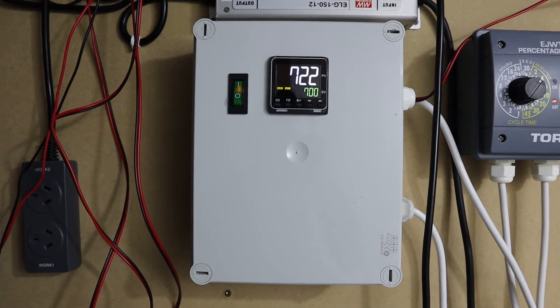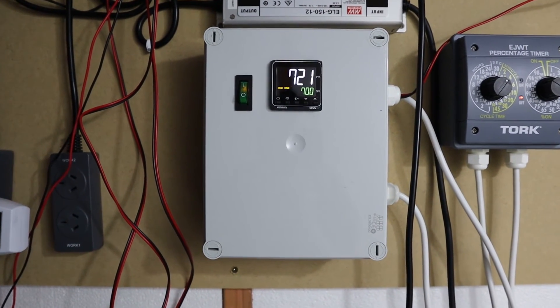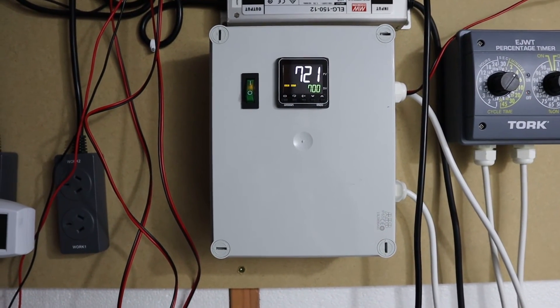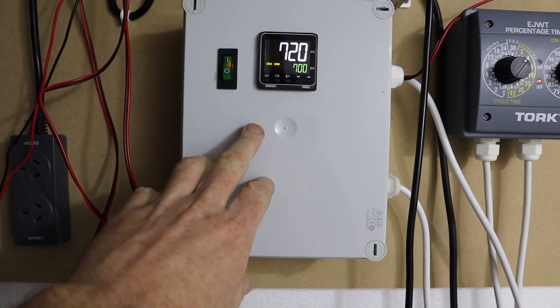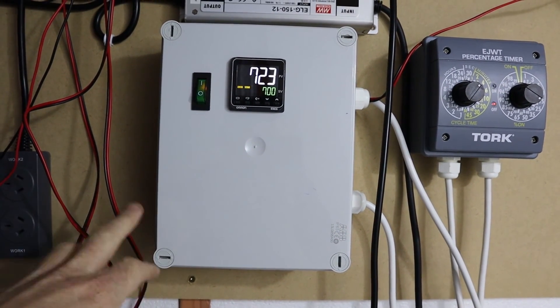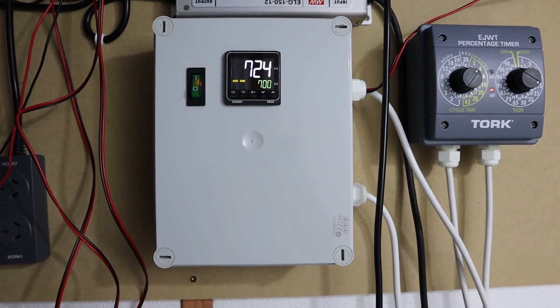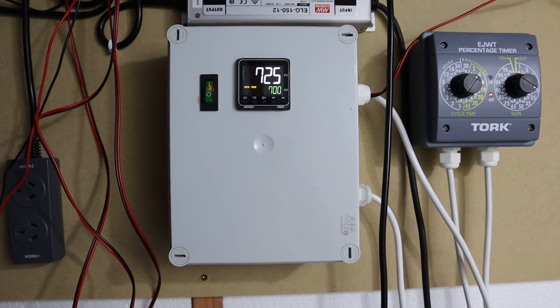So that is the CO2 controller operating and how I have it set up — it's doing a really nice job and I'm really happy with it. When there are a lot of blocks in there the CO2 gets quite high. My air conditioner splits and pumps half the cold air out, keeping warm air in, so during the night when the AC is running more this fan is needed less. During the day when the AC isn't on much, this comes on — it turns on at about 720 ppm and turns off at about 680 ppm. I still need to get that power supply sorted but I've already ordered a new one.